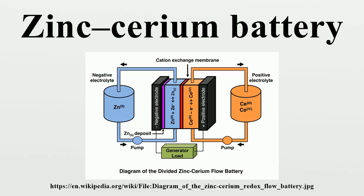The reagents used in the zinc-cerium system are considerably less expensive than those used in the vanadium flow battery. Due to the high standard electrode potentials of both zinc and cerium redox reactions in aqueous media, the open-circuit cell voltage is as high as 2.43 V, among the highest of proposed rechargeable aqueous flow battery systems. This system has the largest cell voltage, and its power density per electrode area is second only to the H₂-Br₂ flow battery.